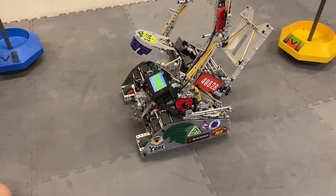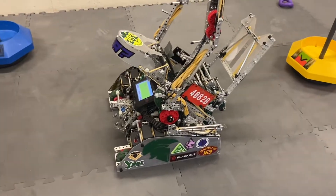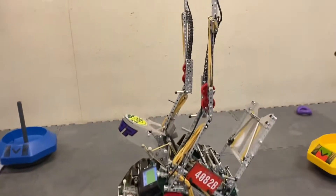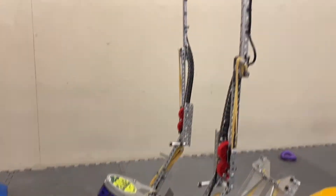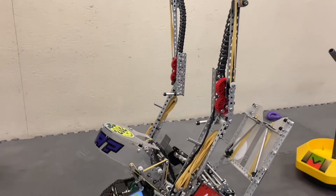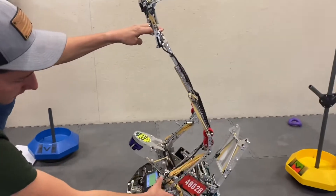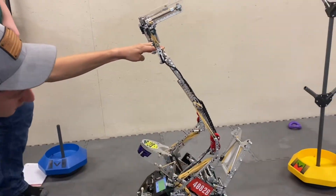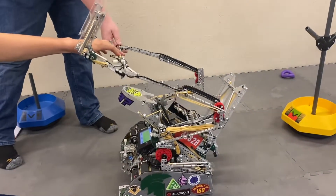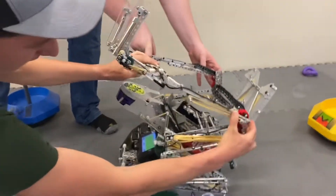The next part of the robot, which might have been the most complex part to build, is the toggle mech. It's a four-bar reverse two-bar with a slide on the top, and it was really tough to get it all to fit in size. It folds down with these gears — this is the four-bar and the two-bar — they both counter-rotate to fold it down, and then the slides fold in back like that.